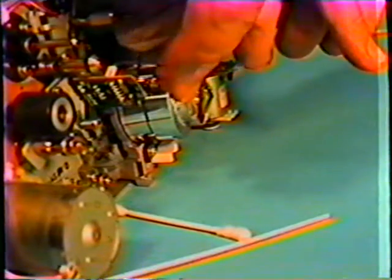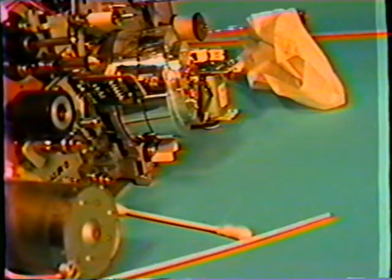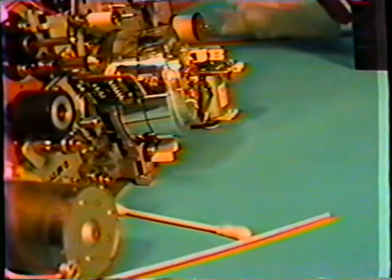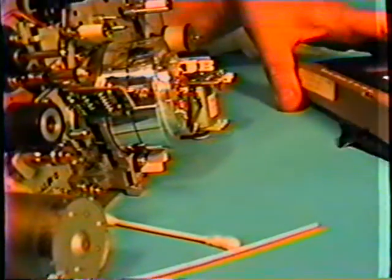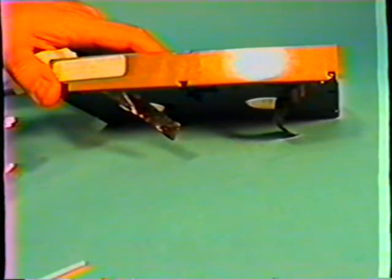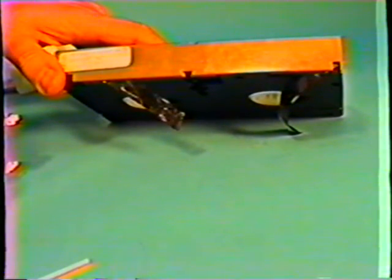Now sometimes what will happen in the machine is there are little air grooves here. Can you see those air grooves there? Those are actual little air grooves. Sometimes you can get a bad tape, or you can make a mistake. You can have a customer that has gone out to a movie store and rented a tape, and if you're living in an area of the country where it gets very cold, and has put a cold tape into a warm machine, that's what's happened to this tape here. It actually has broken the tape. See, it's actually broken. That happened because the tape was too cold, and it was a temperature of approximately 30 degrees outside, maybe 24.